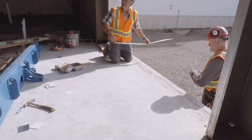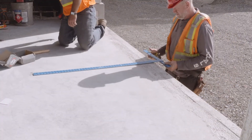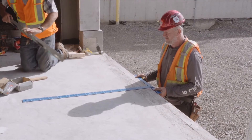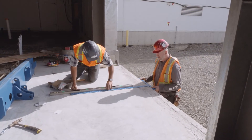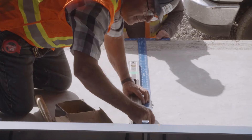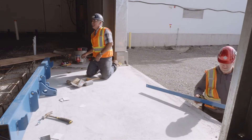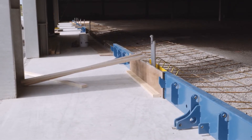What they're doing right now is measuring the center line of the door opening. It is important to identify the center line because you want your dock leveler to lower into the trailer on the center line. If you don't find the center line, that's your main datum — your starting point for the entire system. After you establish the center line, then you do your measurements. If it's not plumb and square, you're going to have a problem.